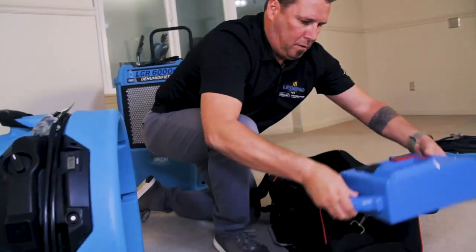For equipment that is UL, CSA, or ETL listed for safety, the moment you change something — swap a plug, add an extension cord, splice a wire — the safety rating ceases to be valid and you could be creating a hazardous situation.